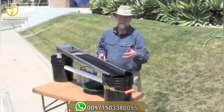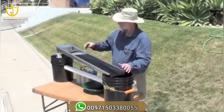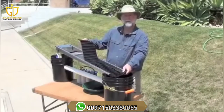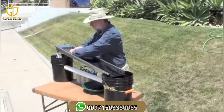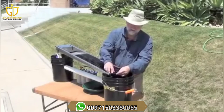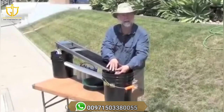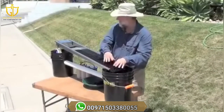We're back with a couple more things on adjustments before we actually run material. The clamp up at the top is real simple — the mat just sticks right underneath it. Sort of take it at an angle and just press it underneath that rib. When you get it underneath, you want it to be sticking over the end about a quarter of an inch. That way you'll have no accumulation underneath here, which can become a problem. So that's how the mat sets in.